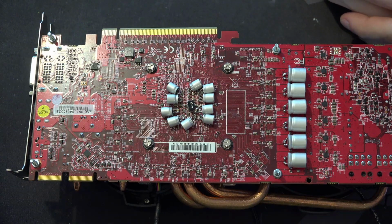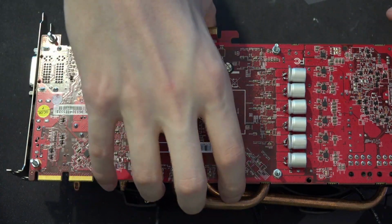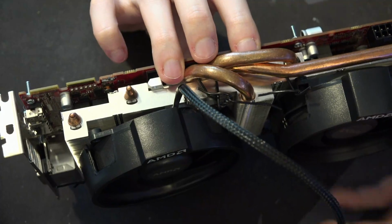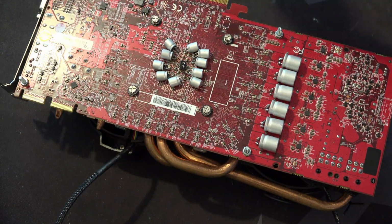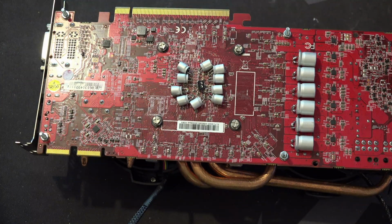So basically I was just doing GT1 because that doesn't give me too much variability in how much it'll heat up, right? I recorded the maximum temperature of the heatsink, which throughout testing was constant, so that's good. That was one thing I was really worried about, making sure that my max temperature after each run was the same. Because if it was any higher, then that run's invalid.